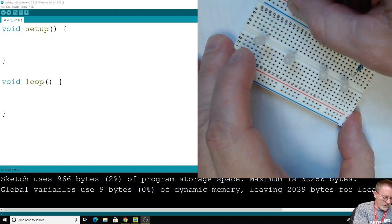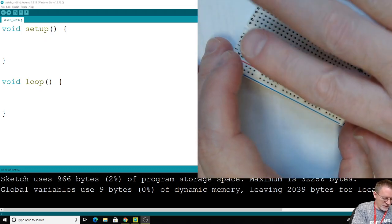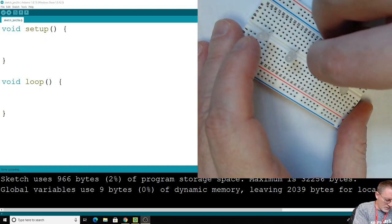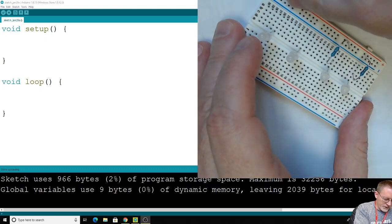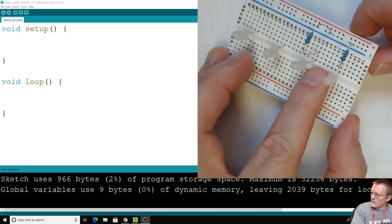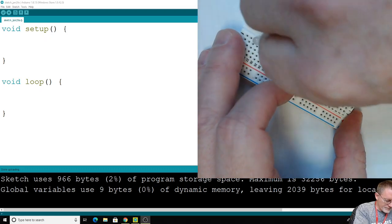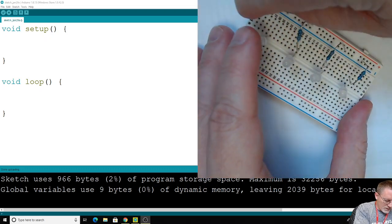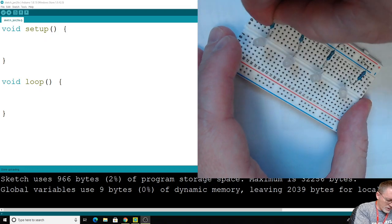We're going to send one wire from here all the way into the Arduino into ground. So I can take all of these and send them into this rail. I can save myself some wires, and that'll be nice. It doesn't matter where along here I put it in. Just got to make sure these two are both in the same row. And off we go. That one there. And one more at the bottom.